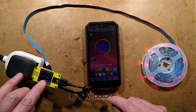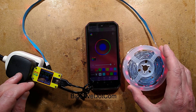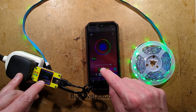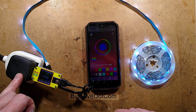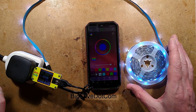Red draws 675 milliamps for the run — I think this is five meters. Green is 659 milliamps and blue is 685. But if you put them all on together at once in RGB white, it comes in at about 1.45 amps. It's not too bad; it means it can theoretically be run off a 2 amp supply.